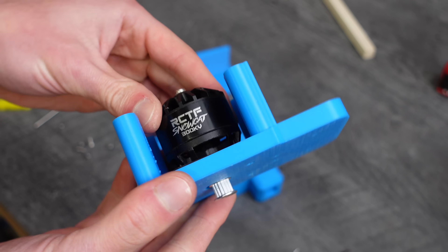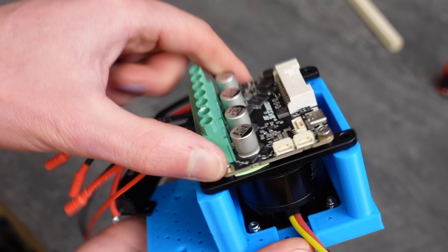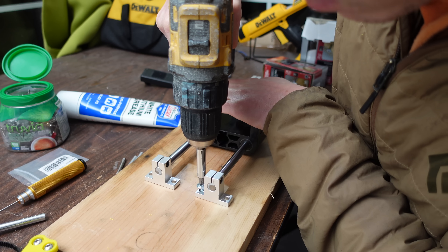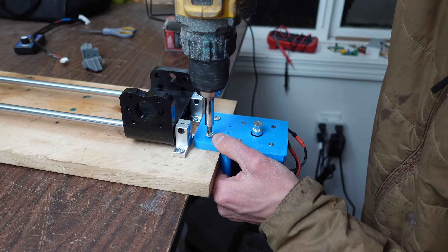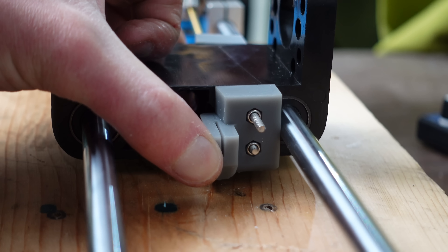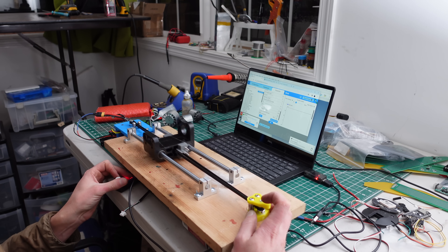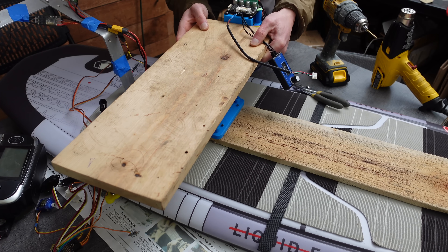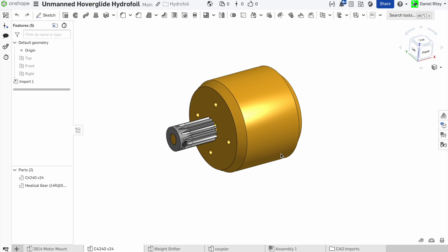Now let's try out Sebastian's idea of controlling roll with a weight shift mechanism. This is a motor left over from the snowcap project, and I glued a magnet to the top of it. That magnet will align perfectly with the Hall Effect encoder on the back of this O-Drive S1 motor controller. I then waterproofed the S1 with epoxy since it was definitely going to get wet. I pulled the Y-axis off a cheap CNC machine and screwed it down to a piece of wood. The servo motor module got screwed on to the end. I used the Formlabs Form 3 Plus to SLA print some little clamps that lock onto this GT2 timing belt. These screw onto the carriage with some super long M3 screws. Next I added some pulleys on the opposite end of the motor to tighten the belt, and set up the O-Drive to do 10 rotations in each direction, using a normal servo PWM signal as the control input. Pretty sweet. I then printed a base plate and used that to attach the whole slider onto the board, and with that, our weight shift mechanism was complete.